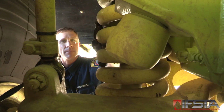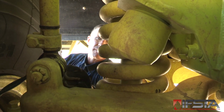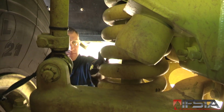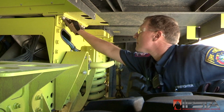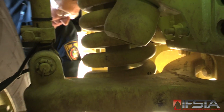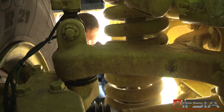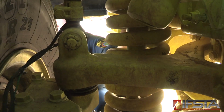Visually inspect the suspension components found behind the left and right wheels. Look for defects involving the torsion bars, springs, spring hangers, shackles, U-bolts, shock absorbers, or mounting hardware. Check for springs with cracked, otherwise broken, or missing leaves. Check that there is no spring deflection when the vehicle is on a level surface.